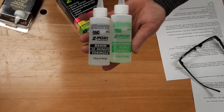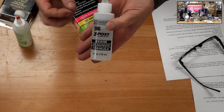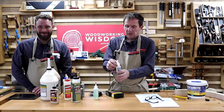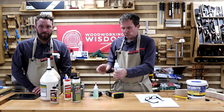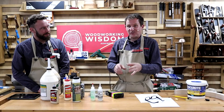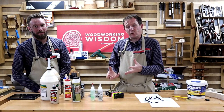Temperature affects epoxy. Ideally keep it cool. If you've had the bottle open for six months to a year, the resin can go to a white crystallised state — but don't throw it away. Submerge the bottle in a cup of hot water and it'll turn back to a resin. Let it cool down before using it though, because heating it shortens your open time dramatically. I used heated epoxy thinking I had 30 minutes and it went off within five minutes.